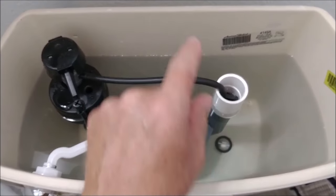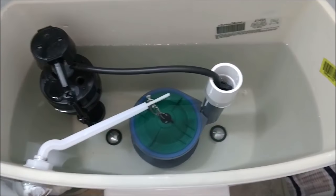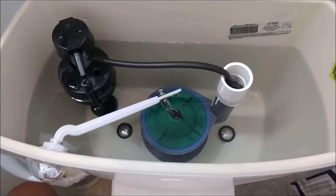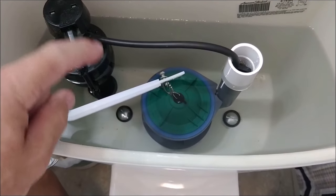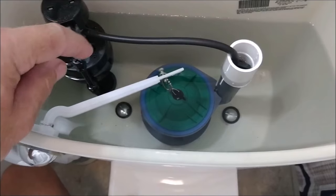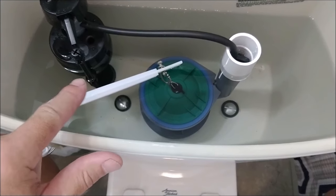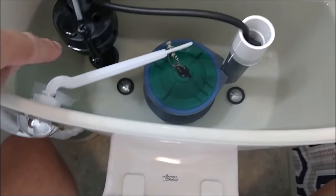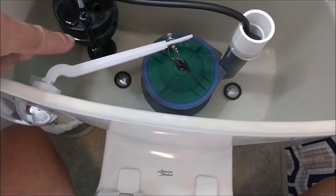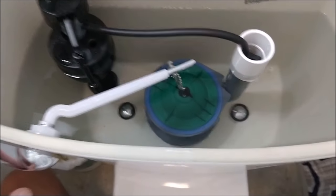This fitting will not fit over the edge of that thing anymore because it's too thick — just drop it down in the hole. As long as there's water going in the hole, that's all that matters. Then make sure that this is turned all the way clockwise in the plus direction so that the float is all the way up, because it seems kind of sticky. Just make sure that little float down there has come up as far as it can go so that the flush is long.